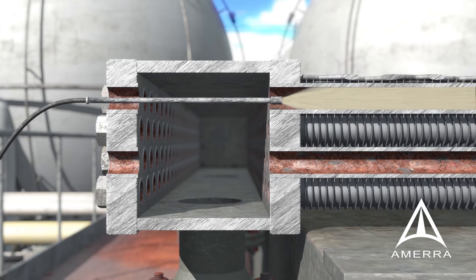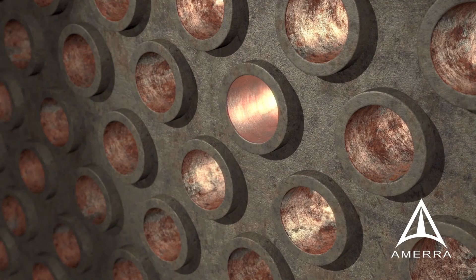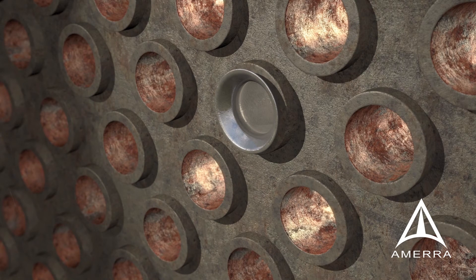As a turnkey service, it maximizes intimate contact of the repair liner to the existing tube. Tube end inserts are a common repair strategy for exchangers. They can be mechanically rolled at both ends or hydraulically expanded and then mechanically rolled at both ends.